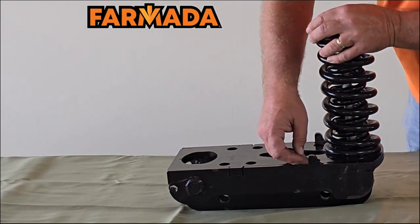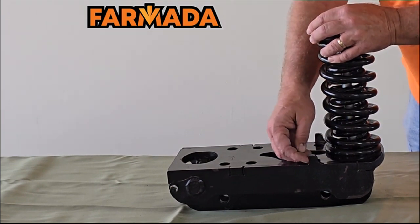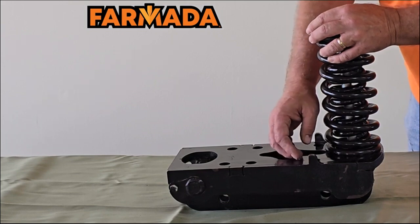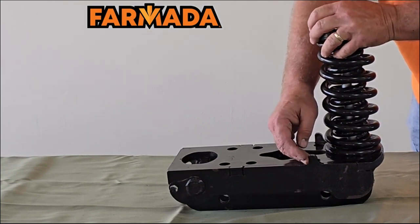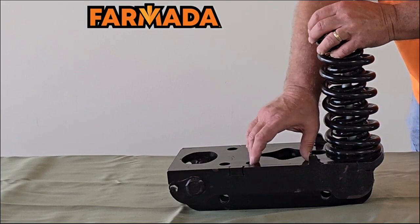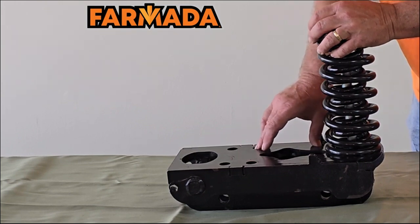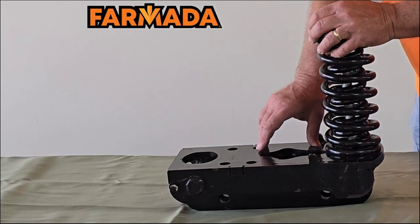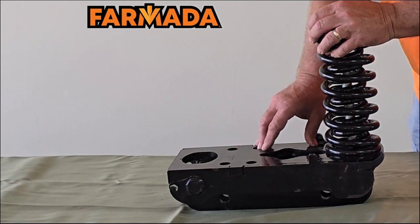You'll also notice that we've got two small tabs here. This butts up to the front of your applicator frame. What that does is keep a consistent force left to right against your frame or machine, keeps it square, and helps our U-bolts stay tight and reduce fatigue on them as well. Incidentally, we use three-quarter inch U-bolts on every row unit. A lot of our competitors are five-eighths, but we actually use three-quarter inch bolts to help hold this tight and straight with your frame.